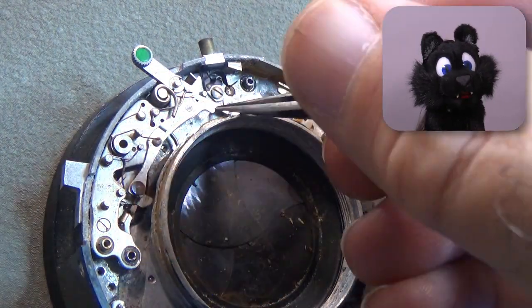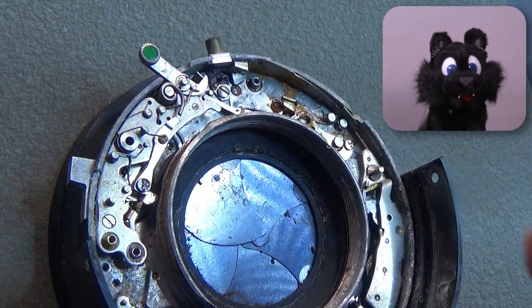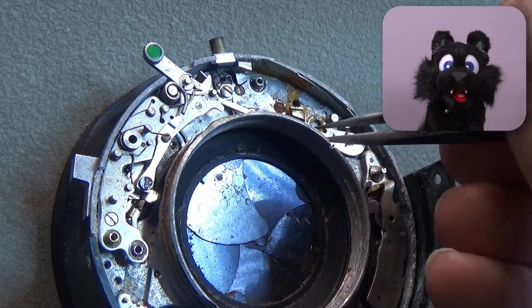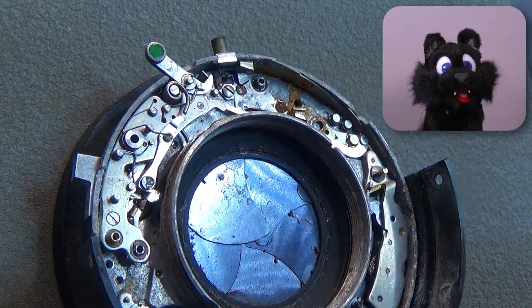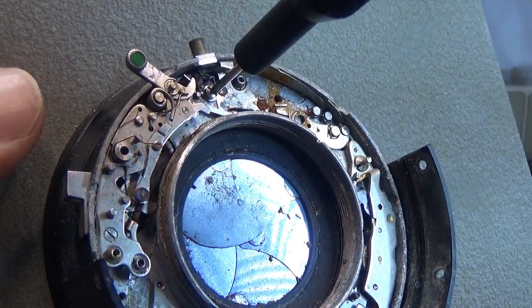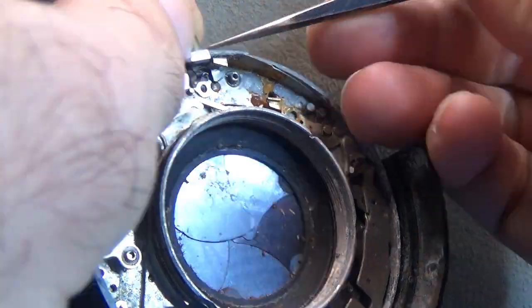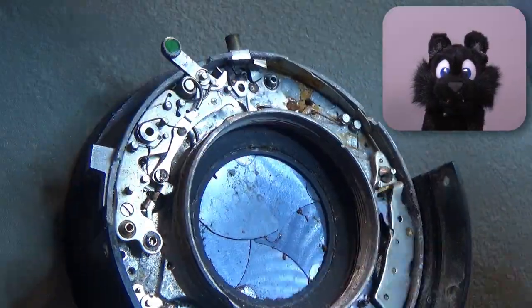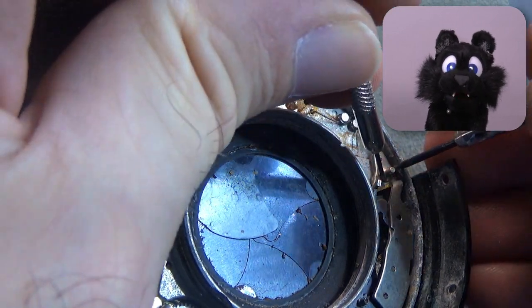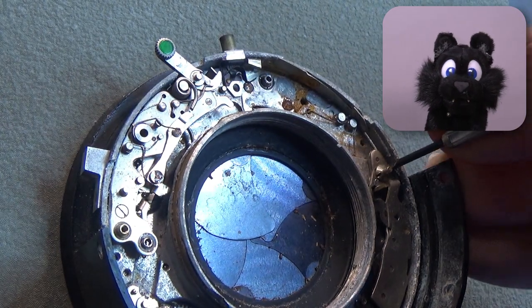The green lever is the XM toggle switch that controls the timing for the flash contact — see my Kodak flash mod video for a detailed explanation on that. Another tiny part removed. This one controls the actual shutter, converting the almost linear movement of the linkage into a fast turning motion to open and close the blades. The next part in the disassembly is the manual shutter button. To set up the camera and adjust the focus, you need to look through the lens, so these shutters have a 'lock the shutter open' button.